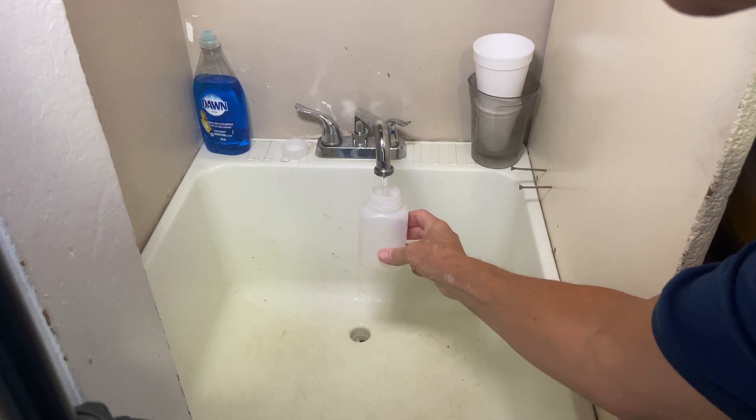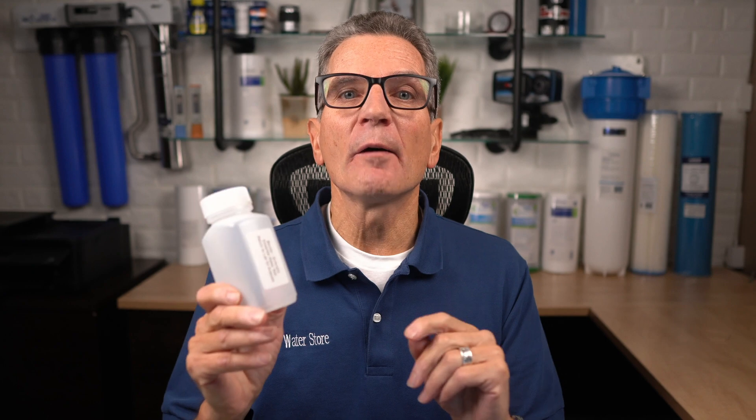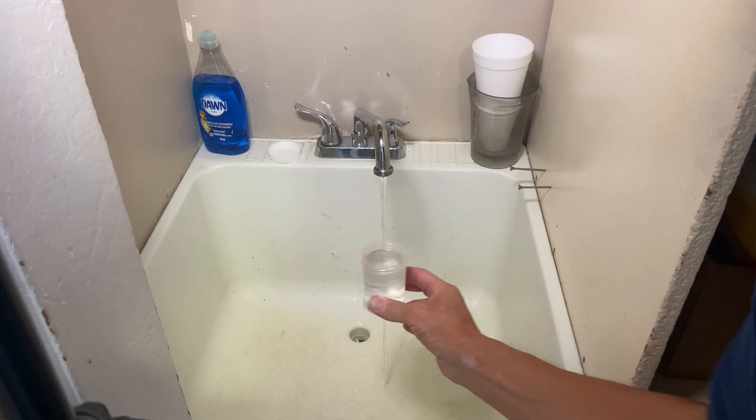Keep in mind you'll be sampling cold water only. Use a low water flow when filling the containers and do not rinse out the containers or their lids. Start sampling with the large bottle first — a straw is recommended — and fill up to the shoulder. Collect this sample after the water has been stagnant in the pipes for six or more hours; that water will have had time to interact with your plumbing and may reveal plumbing-related issues. Then collect the small bottle after fully flushing — run the water for five minutes, then collect the sample.